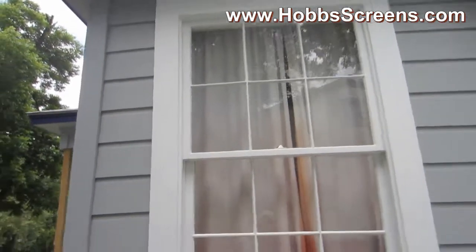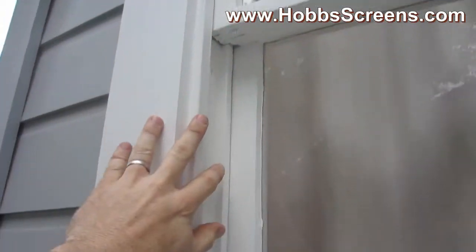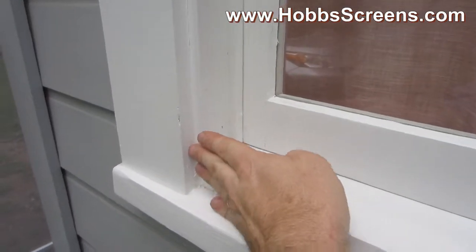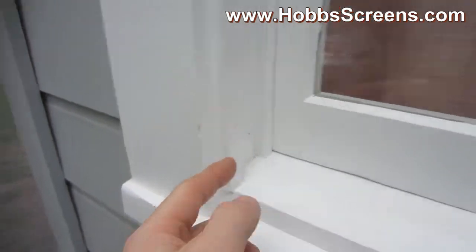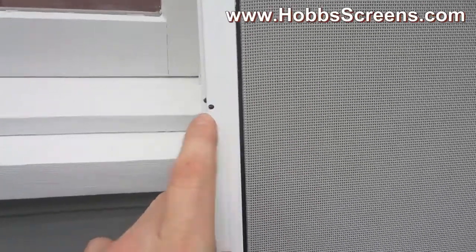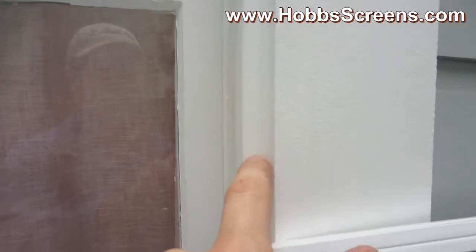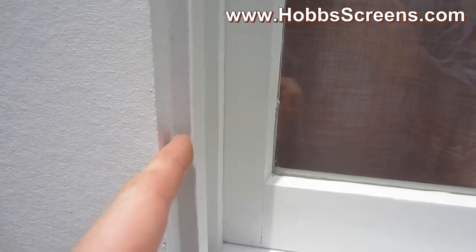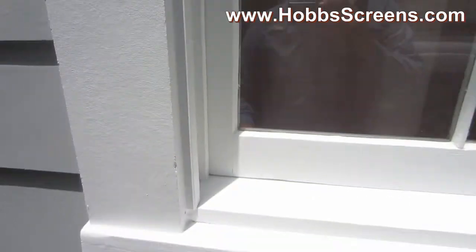These are wood windows — all of this here is wood. So what we're going to do is make our screens so they fit right up against this stop right here. There are our screens. We'll put little holes there and pilot drill our holes because we're going to use wood screws. The screen is going to sit on top of the stop and you want to screw your wood screw in so it gets into that little piece of wood right there.